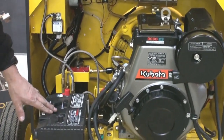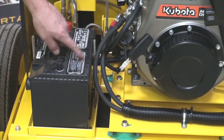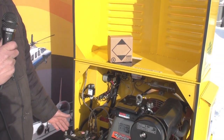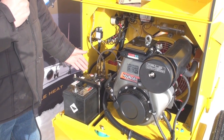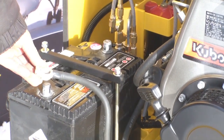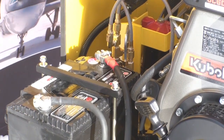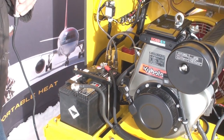To prepare the battery, take the covers off and add the electrolyte. Charge the battery 6 to 8 hours until fully charged. Once charged, connect the battery post negative to negative, positive to positive. Tighten the bolt with a half-inch wrench.